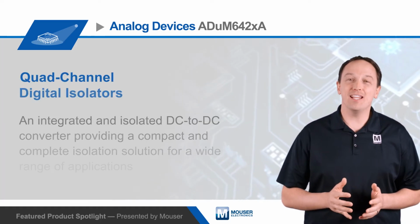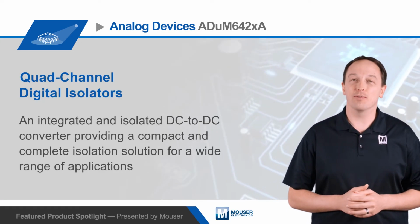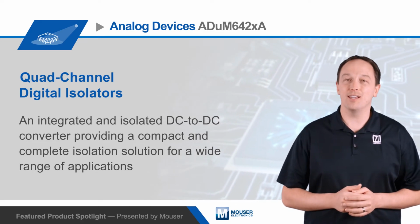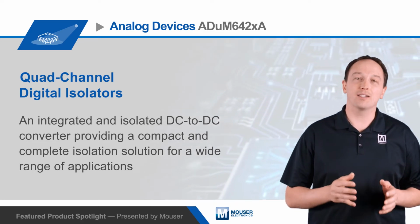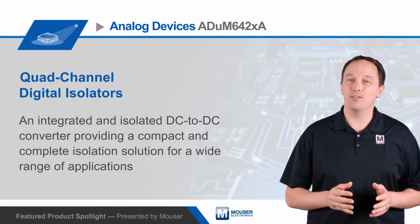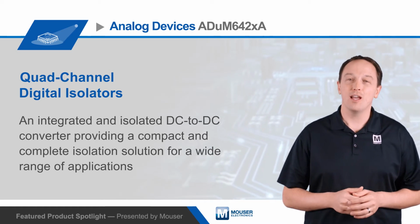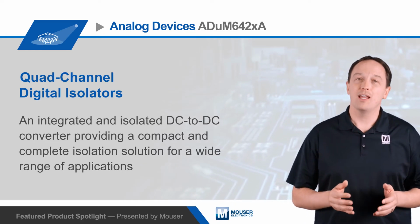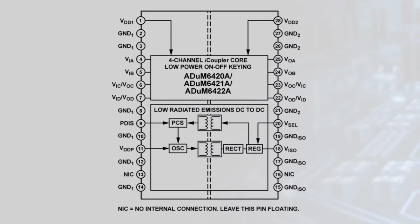Analog Devices' ADuM642xA series of quad-channel digital isolators have an integrated and isolated DC-to-DC converter, providing a compact and complete isolation solution for applications such as RS-232 transceivers, isolated sensor interfaces, power supply startup bias and gate drives, and industrial PLCs. This makes the ADuM642xA series a total solution.